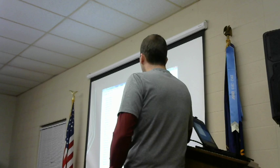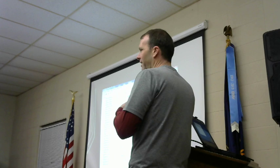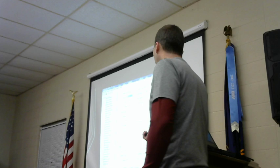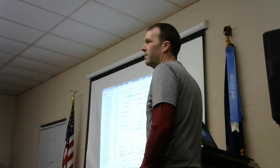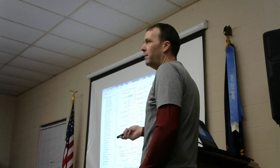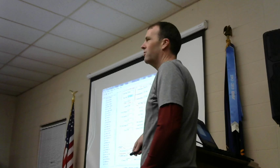Reverse burst, and you can see QT reverse here, 180, the other one's 120. What that does is it reverses, not really the polarity, but on your PL tone, it inverts it so you don't hear any static after you unkey. And there is a standard for that. 180 is your general Motorola reverse burst, and 120 is everybody else. So on an analog repeater, the repeater has to be set up too. Like the 6.4 and the 9.1 are both Motorola repeaters, so you want to set it to 180. But if you don't know what the repeater is, you can take a guess if you're really concerned about it. But that's all that is.